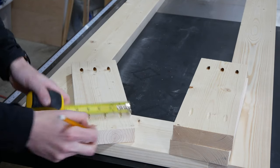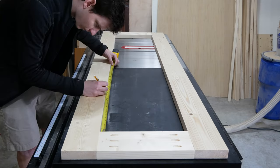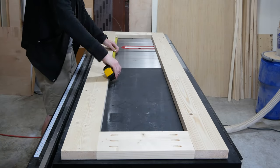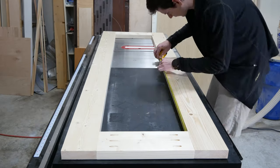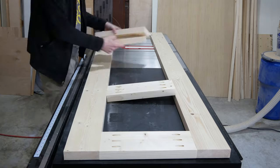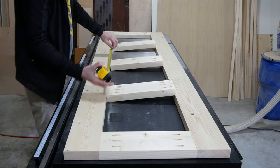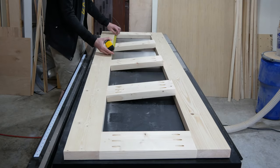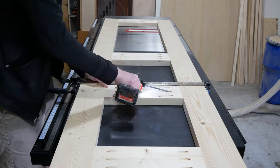To locate the middle three rails I marked the center on each of them and then marked on the door to evenly space them. These marks were calculated by taking the distance between the middle of the top and bottom rails and dividing by the number of glass panels, which in my case is four. Getting these measurements right can be confusing so it's always good to check to make sure that they're evenly spaced. Then I clamped and screwed in the center rail as well as the two remaining rails.